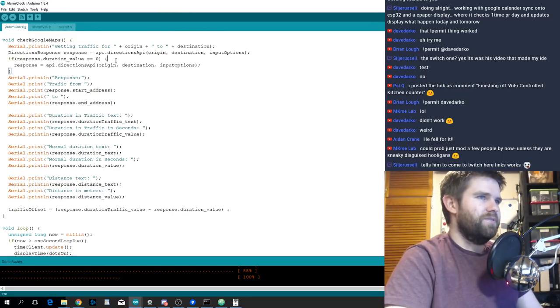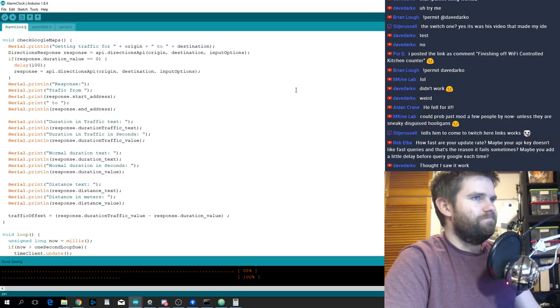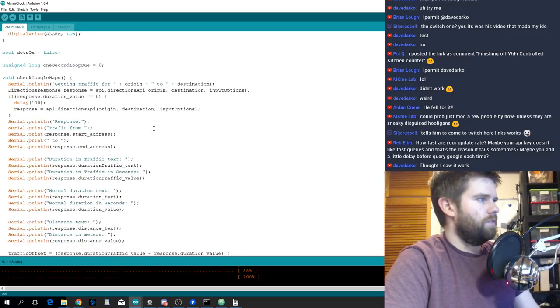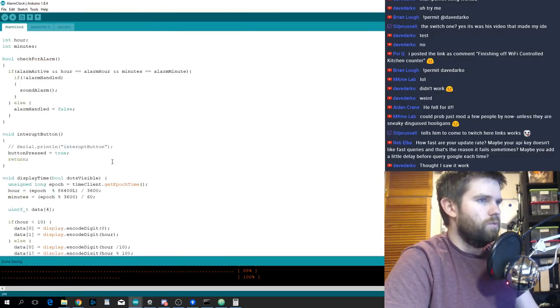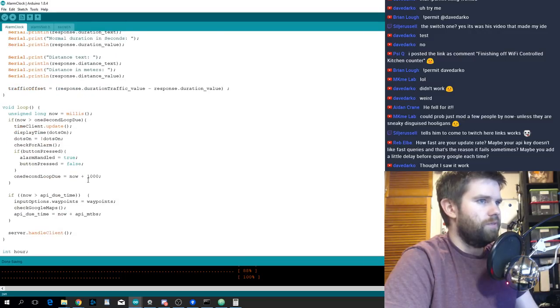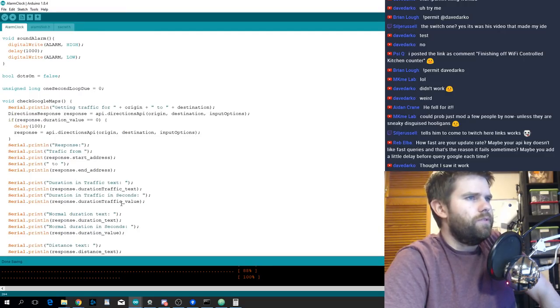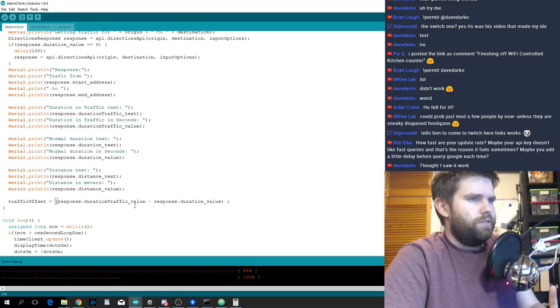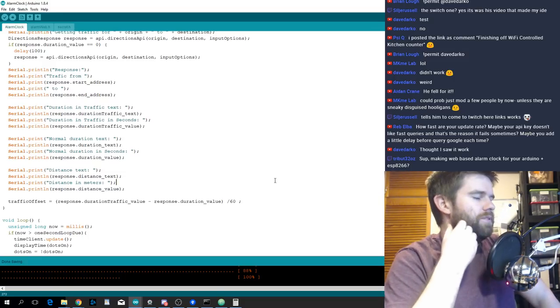Yeah, I should put a delay here if it doesn't work, actually. Delay 100. That's a good suggestion, Reb. The refresh rate's pretty slow at the moment. It's every 60 seconds is what it should be, anyways. If we take a look at the loop again, API 2 flip, yeah, that's 60 seconds. So every 60 seconds it's doing this Google Maps check. So it should be okay. Yeah, so this is the duration traffic value minus the regular duration, and then we'll divide it by 60. Hey, Tribute, yep, that's exactly what we're doing.